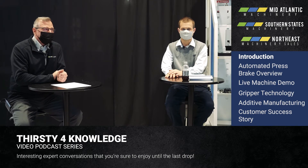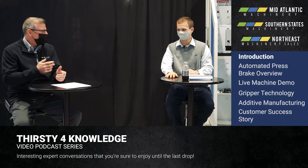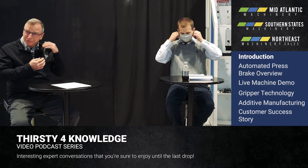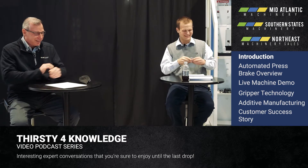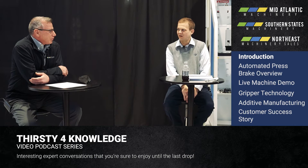Today we'll be talking about our collaborative robot connected and integrated to a Trumpf press brake. A collaborative robot is a force and torque limited robot. The robots of the past would continue to hit you and just go right through you. This robot will actually bump into you, and if it sees that there's something in its way that it doesn't expect, it stops. So that allows us to put these robots out in applications on a shop floor without the caging and all that stuff around them.